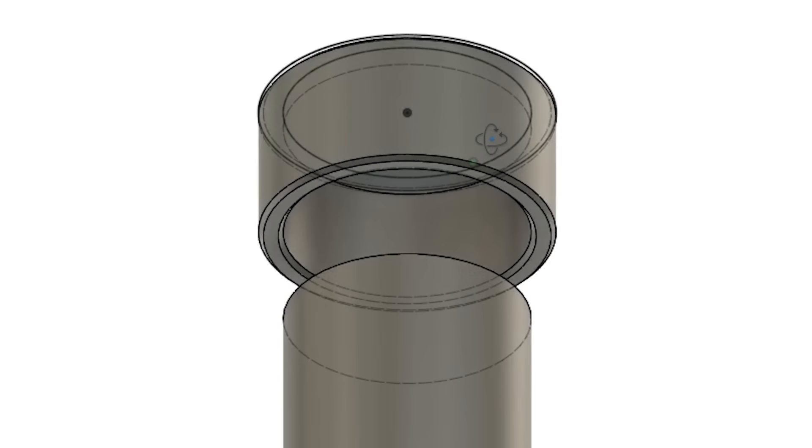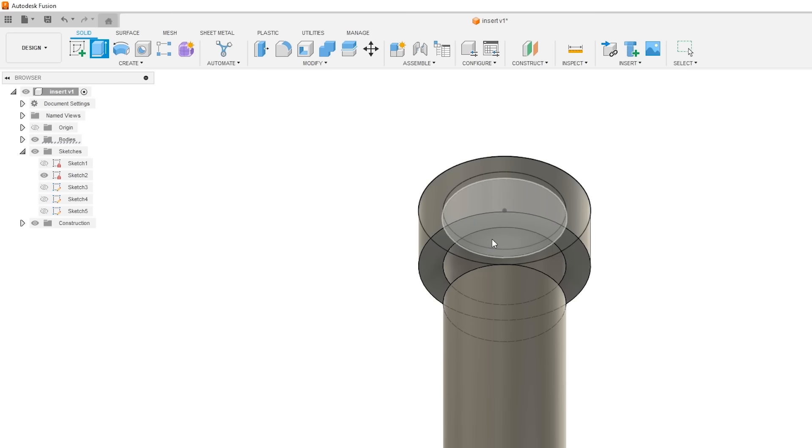With these types of fits you're also restricted a little bit by layer height, because if you have a really coarse resolution on these parts then those layers interlock with each other. So these friction fits can be very tough if you're not doing it quite right. There are some tricks you can do to reduce the amount of surface contact between the two parts — you might add ripples to the interior or something along those lines, just so that you don't have too much contact. You kind of want to avoid pure friction fits because since they are a high-tolerance part, the shrinkage of the material and everything else makes them tough to tune.